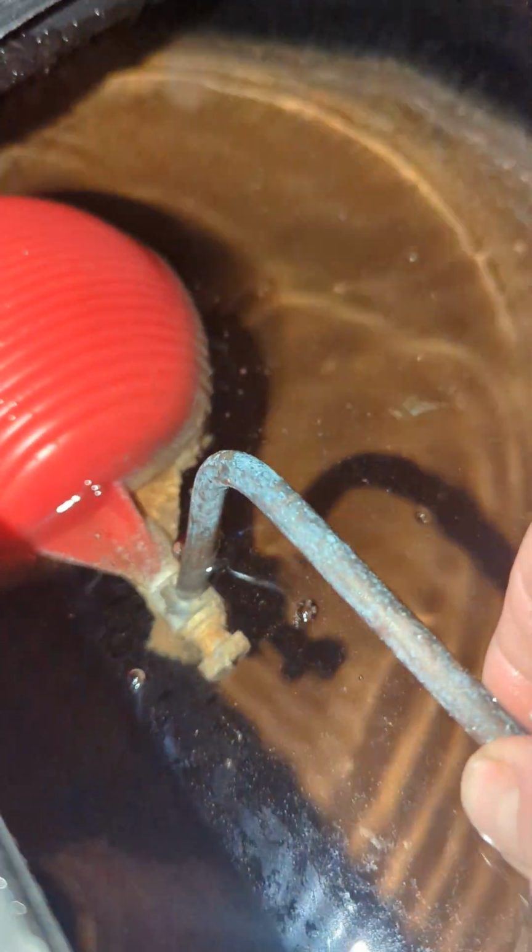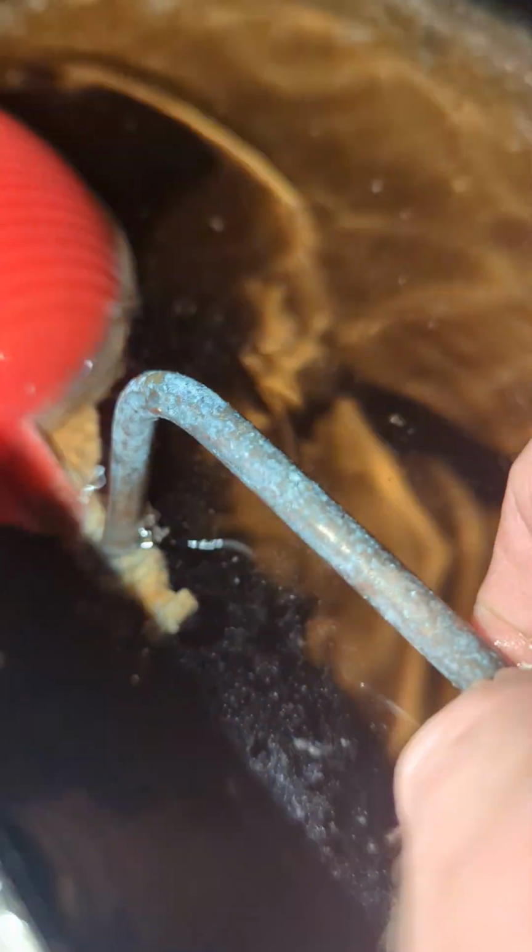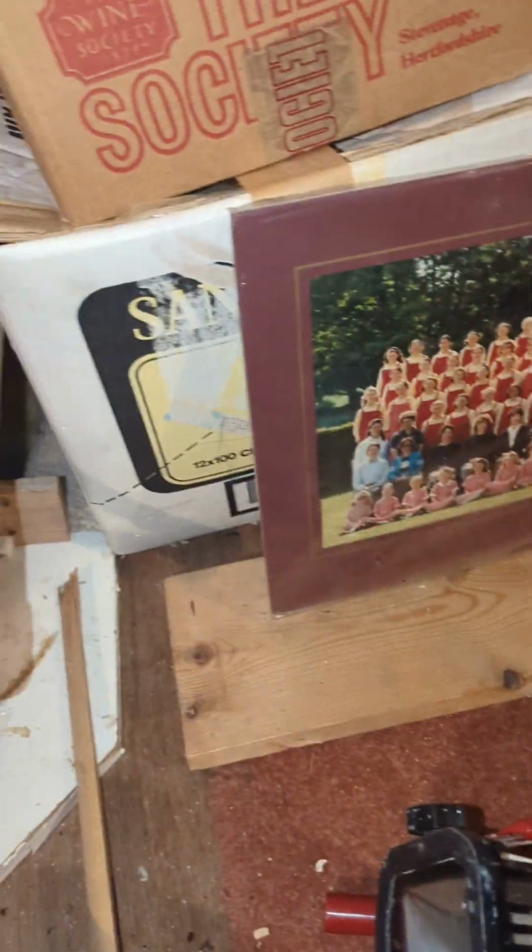And the tank looks relatively new, but this ballcock has been letting by. As you can see, the float is underneath the water. Now, can you see all the brown? That's all sludge from your heating system. Now this can cause damage to your pump and to your boiler, and cause your heating system to be inefficient. So what I'm going to do is try and get some of this muck out before we put in the new float valve.